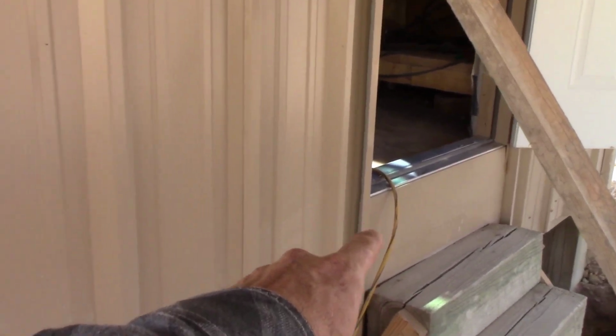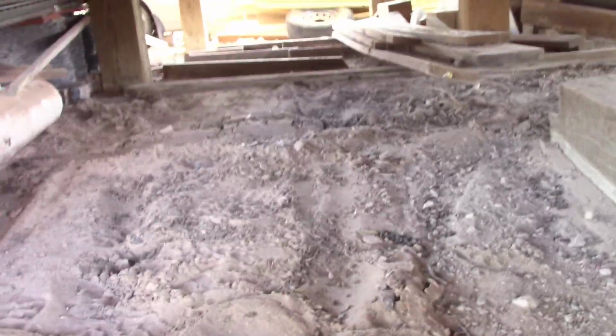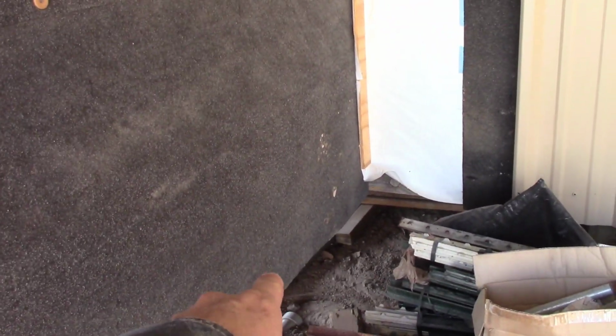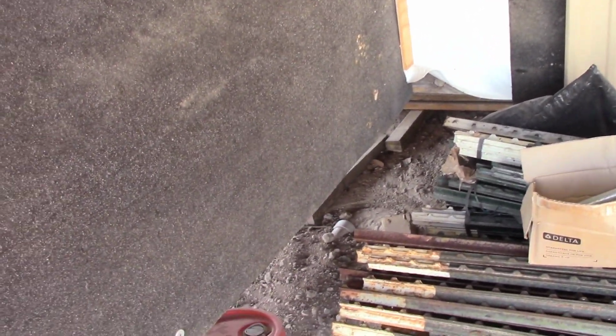For this time, I'm just going to try to get that conduit ran out and stubbed out from underneath the edge of the building, and then I've got 2 more 2-inch that are going to go right up here, that are off of the heat exchanger I'm going to make for the fireplace that's in there, little wood burning stove. I don't have all the material to do everything underneath there. I've got another 2-inch that's going to run from the corner of the restroom, and that's a hot water return. And it'll run over to that same little mechanical room.